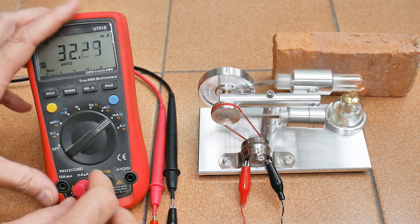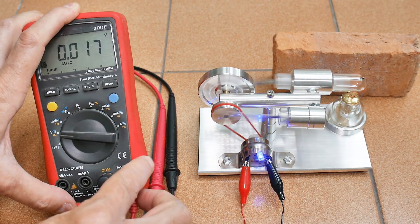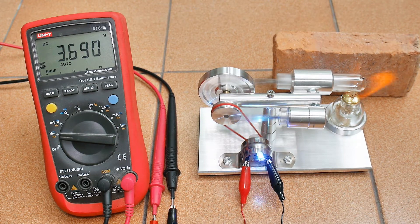That's not too bad. Let's go back to the voltage. About 4.5 volts — so it looks like it's in the roughly 4-ish range, bobbing up and down. Definitely want a voltage regulator on this. Not too bad — about the same as a couple of button batteries or so. Well, that was it for this test of generation power from a Stirling engine with a little generator on it. Hope you found it useful and interesting in your Stirling engine experimentation.